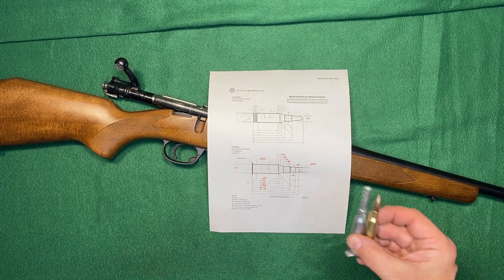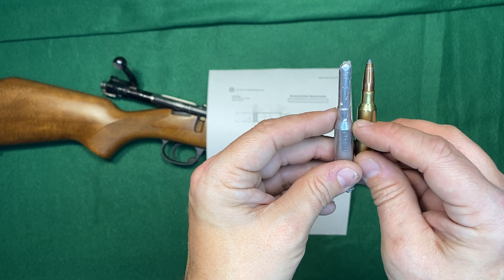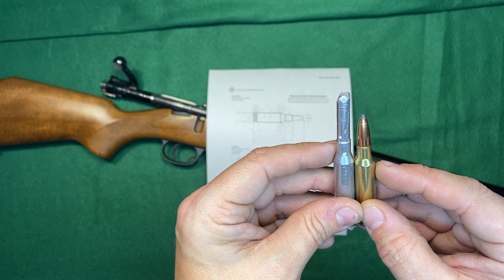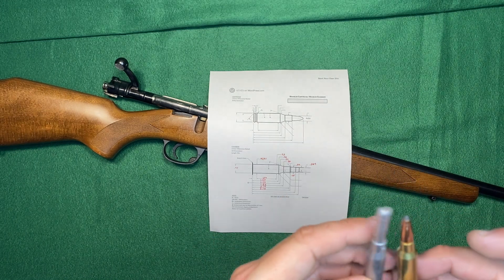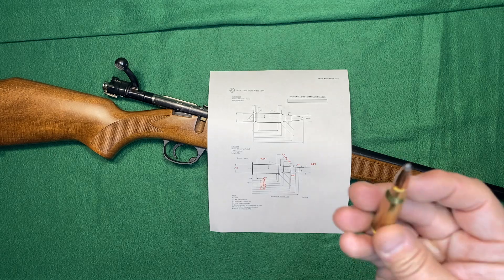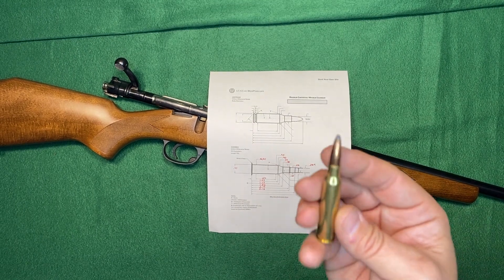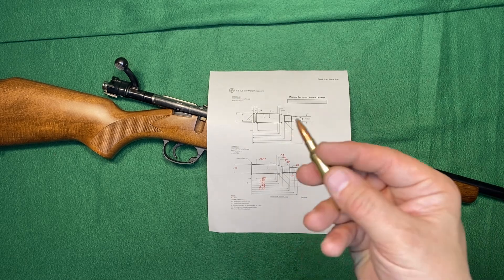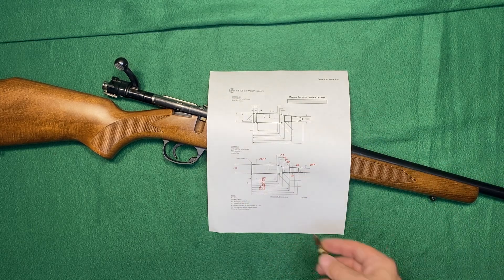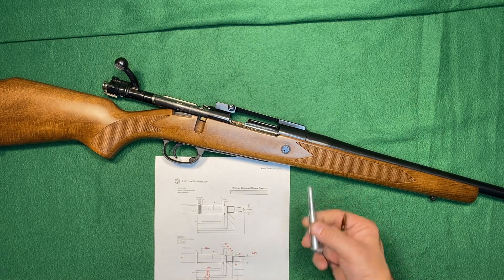When you're trying to chamber standard 6.5 by 55, that shoulder is hitting this angle much sooner — you can't get a fully forward chambering. You're hitting this before it will fully chamber; it actually kind of gets stuck in there. So this isn't going to work the way an Ackley Improved does with my 25-06, where you can just put factory ammo in, shoot it, and end up with fire-formed brass. This poses a new situation where I have to find a way of getting brass formed to this shape.